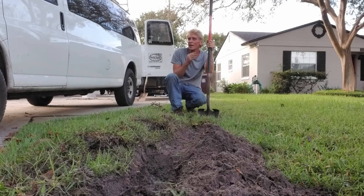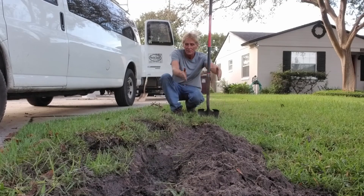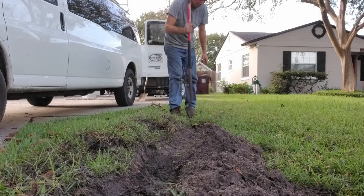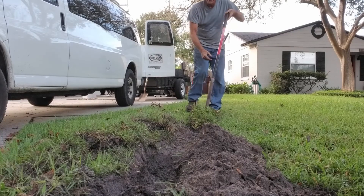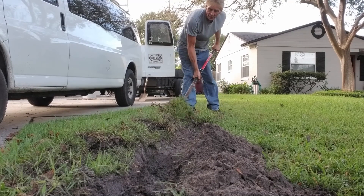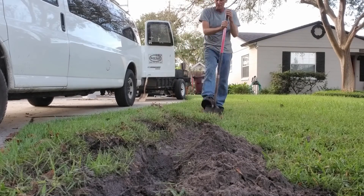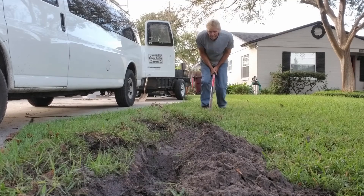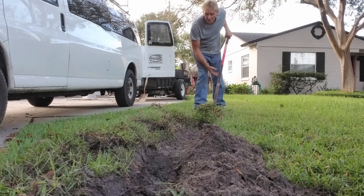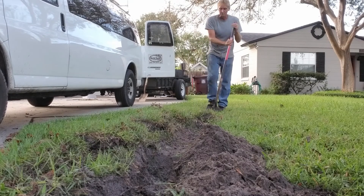Sometimes we lay plastic out here on the side — it's easier because you can push the sod right back in. Cut the sod in two strips, take your shovel and slice right down through it. Come back about a foot and just take off one-foot sections. Scrape it — there are a lot of tree roots right here — and then set it nicely alongside your trench, because you're going to put it back. Do this all the way down and you'll have a nice, clean installation. Try to take care of that sod so it goes back nicely.